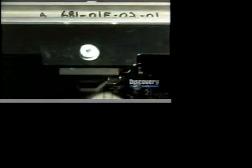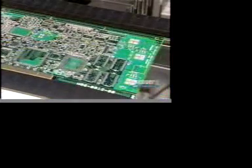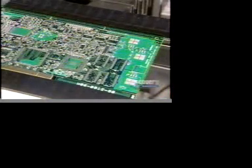The printing blades go into action. They spread the soldering paste on the stencil. This paste runs through the stencil holes and covers the metallic surfaces of the printed circuit board, which will establish the electric current. Here is the difference between an unprinted card and another printed one. The unprinted card surface is much more shiny.